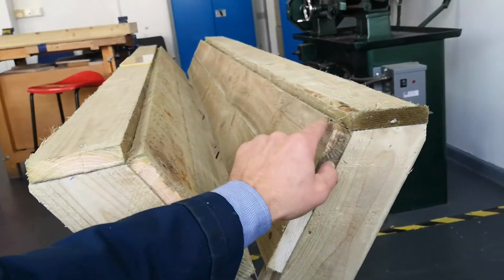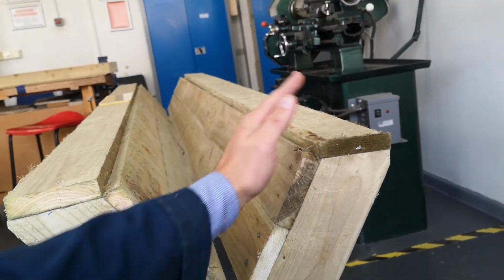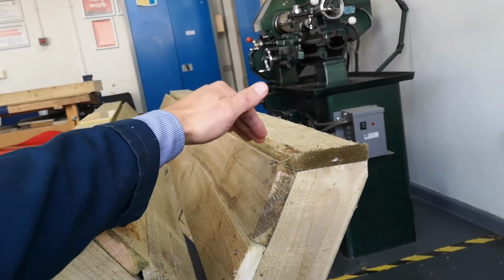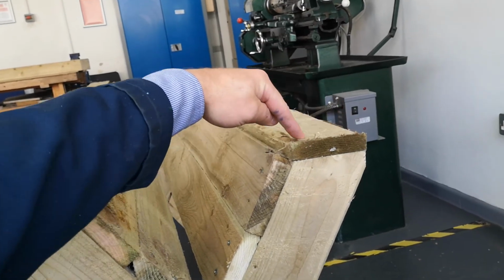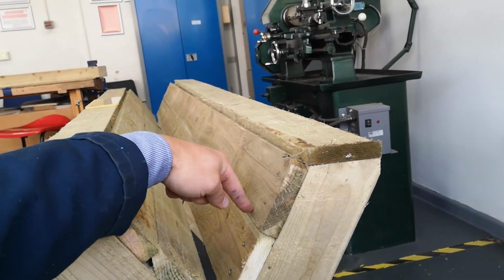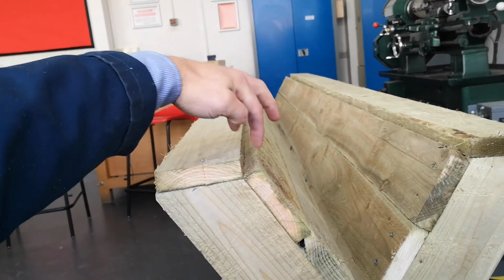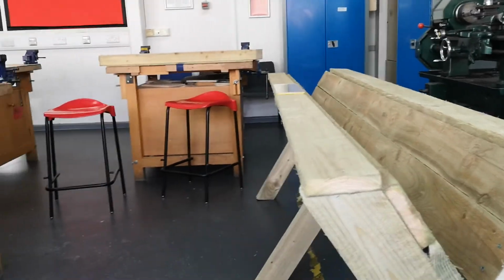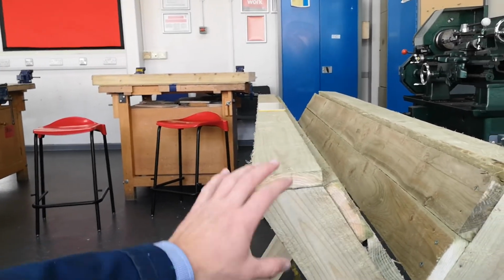At the top of the polythene, we're going to unscrew these top finishing off panels here, and we're going to tuck the polythene underneath here so that there's no horrible edge of the polythene on show. So you'll just see this top edge here. It's going to be polythene down here, polythene up here, polythene's tucked underneath this edge, and then you'll just see the nice, well finished, treated Douglas fir.